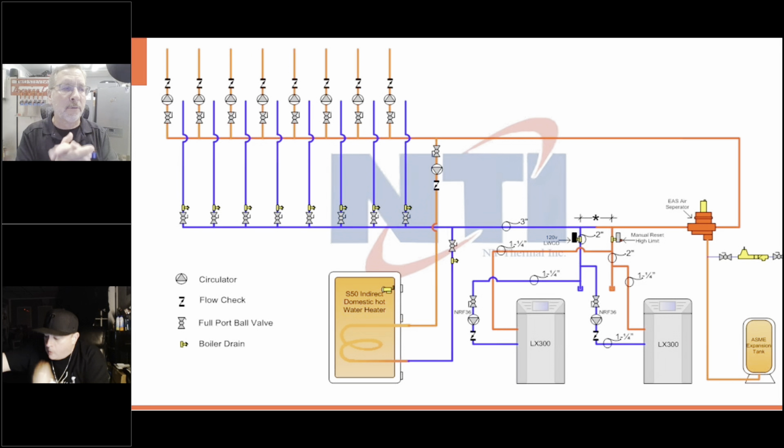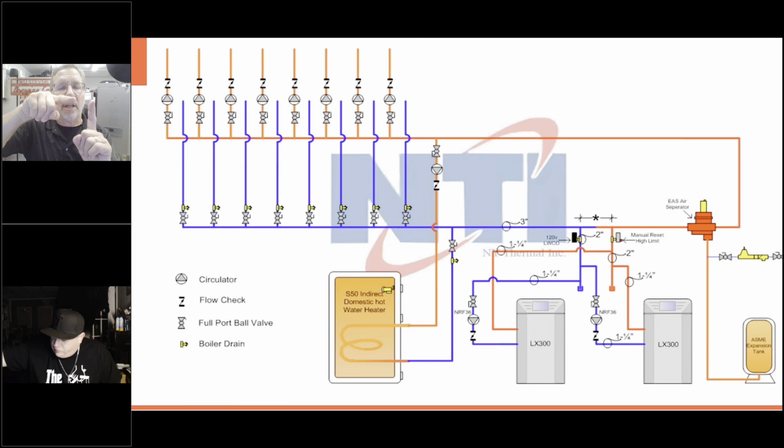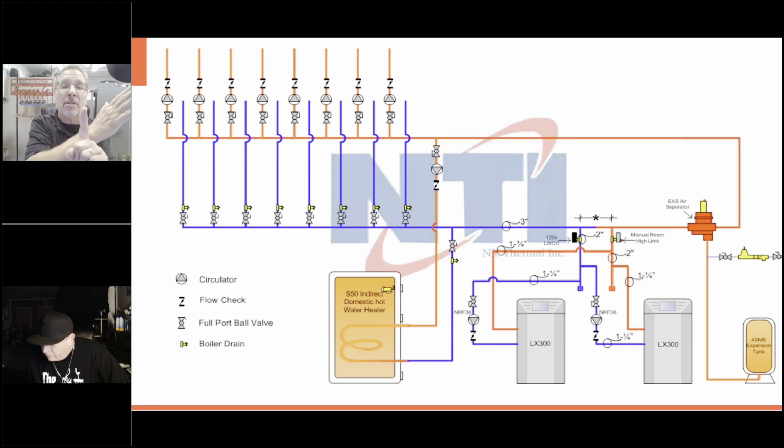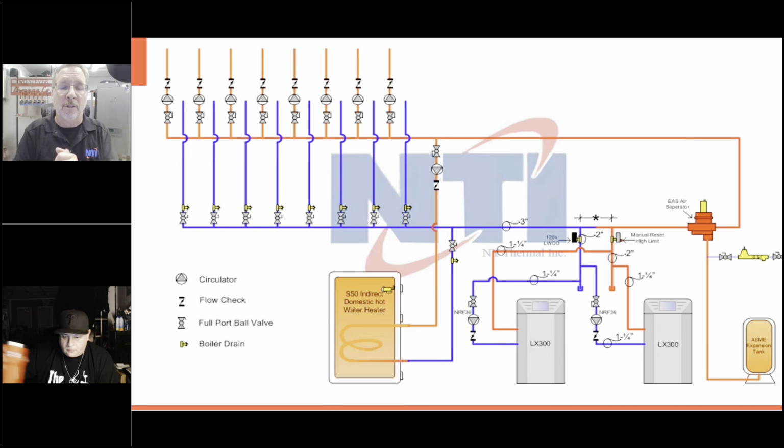Some now have a dip switch for it. But the ZR is the power going to the relays. That's always powering your thermostats. And then that power is jumped over to the circulators to power the circulators. If you break that jumper, everything still stays on, but the circulators no longer have power. This is on all your relay controls that are out there. So it worked. It was just more controls and more wiring. Didn't like it so much.